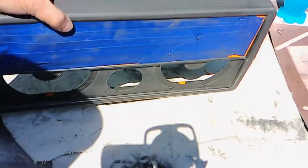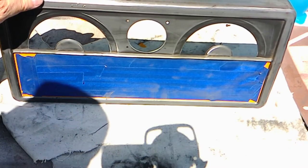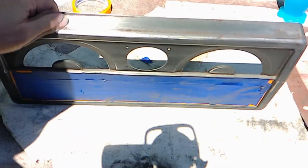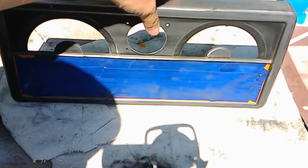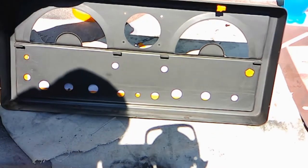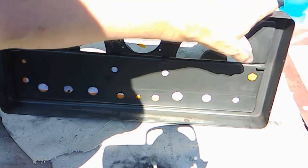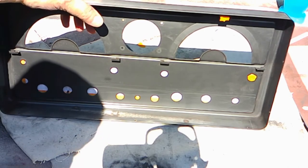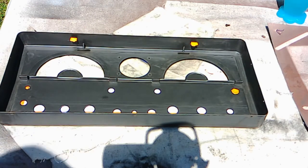So I prepped it and then I sanded it. 320 followed by 600 followed by 1500. It doesn't look like it, but that's a really smooth surface. And even though that's corroded, I think it will be okay once it's painted with Rust-Oleum primer. And that's what we'll do first. You prep the backside too, because the light bulbs get their ground from a bare piece of the metal right there. And there's a brass bushing right there for the antenna compensator. There's a model 1D feature. So we'll shoot this with a couple coats of primer. I won't do the back with anything but primer.